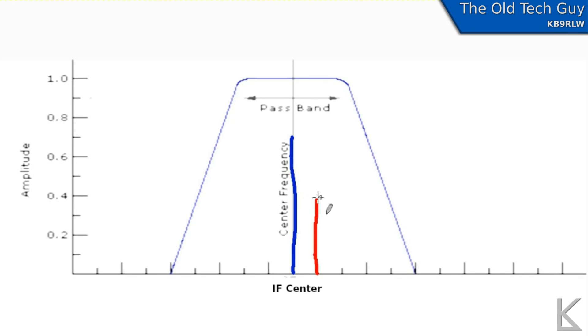What if I want to filter out just that signal? I could try to move the entire passband filter itself in that direction, but what's going to happen is the attenuation that occurs is going to cut into the signal that I'm interested in. By the time I get this over far enough where this interfering signal is, the signal that I'm interested in is going to end up being partially attenuated by this side of the filter. So that's no good.